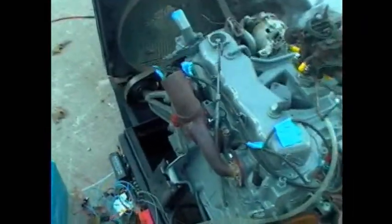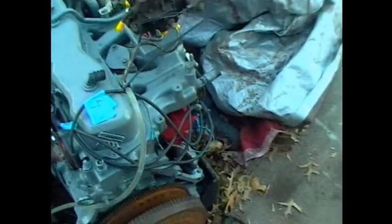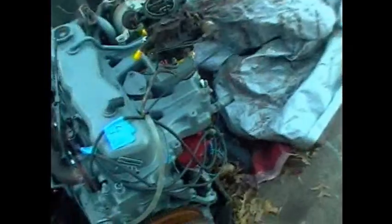But yeah, it runs. It is no longer fuel injected. It's using a 2-barrel carburetor. If anybody has any questions, say you're doing a carburetor conversion on an S10 that uses one of these motors, just go ahead and ask. I can probably provide a handwritten diagram of some type of wiring. It's fairly simple. You just provide 12 volts to the coil and 12 volts to the distributor, and then hook everything up like you would on a TBI truck, and it should be pretty well. It runs. It actually advances. It doesn't bog by any means with that carburetor.